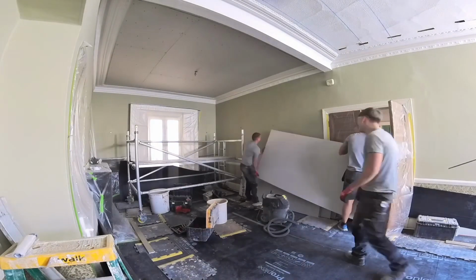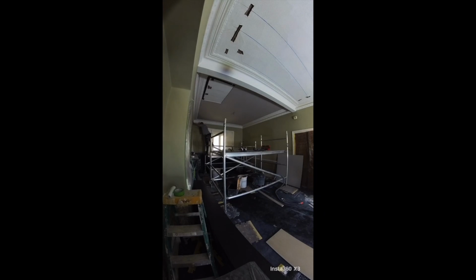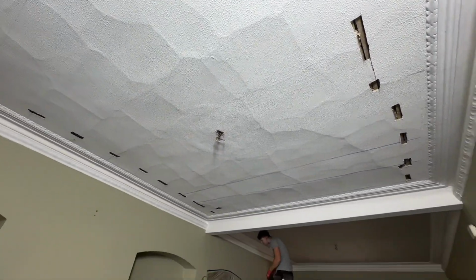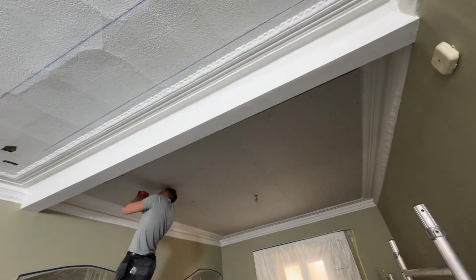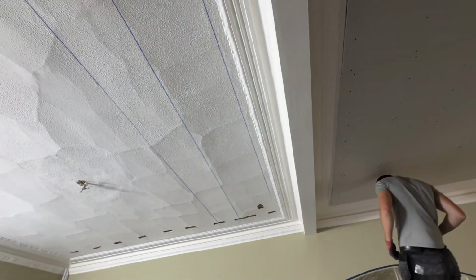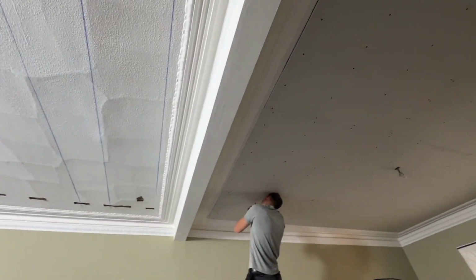We bring in the plasterboards. You can see actually a sneaky peek there. We've actually done the ceiling there, and this is a little flashback here using funky angling. It was in a particularly horrific condition, and this ceiling was in drastic need of renovation. So this method, fixing up new plasterboards, notice how many screws there are. There is 7 per 1.2 meters, which is exactly how many you need.